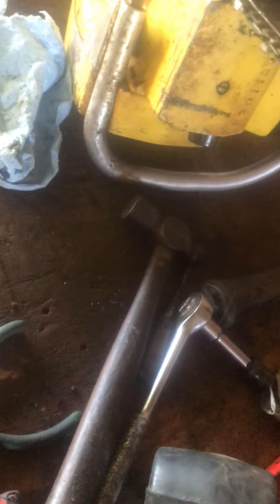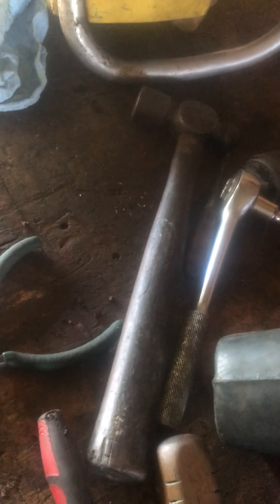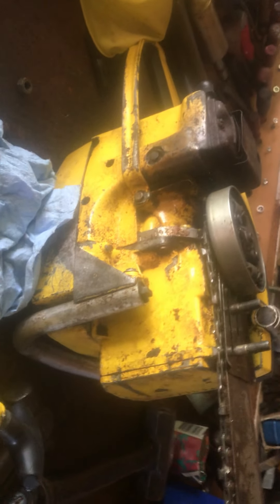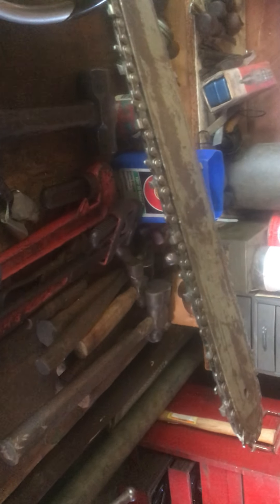On this 210 versus the 1010 — before I leave, you can see where it's gonna sit. These two holes right here line up with these two bolts, and then you put your nut on there, thread it down, and tighten it — and that's basically holding it on. I hope this helps anyone who is doing one of these saws, because I did not see much on this on YouTube. I saw one YouTuber doing a video if you want to put a longer bar on this saw, but I highly recommend just staying with stock — sometimes if you run too big of a bar you can overheat the saw.